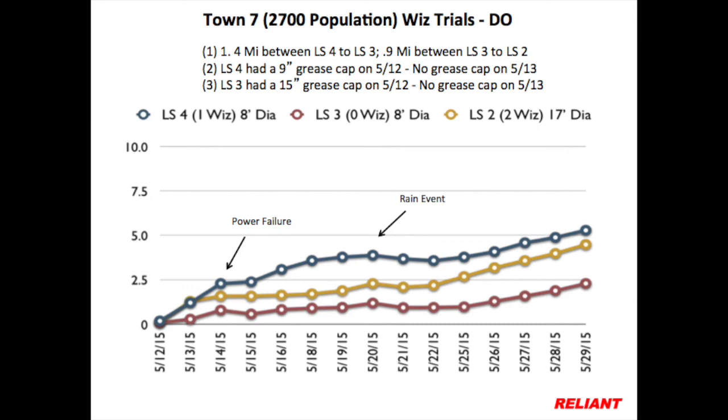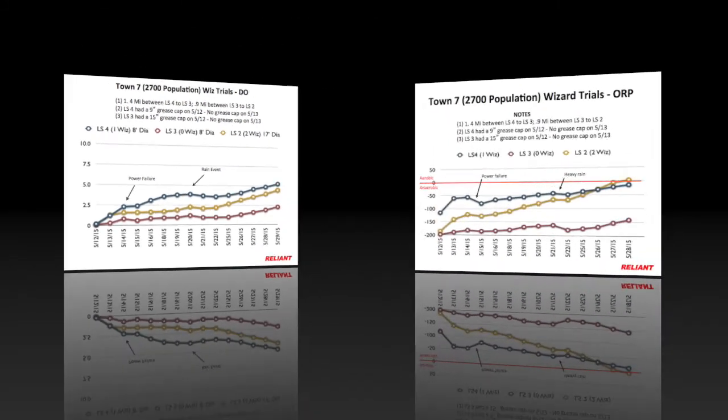Notice in this graph that the dissolved oxygen content at the beginning of a trial was always 0 or almost 0. Within just a matter of days, with the use of the Wet Well Wizard, that DO level could be raised to a level of 5 ppm dissolved oxygen even after a pump-out condition. It seems as though 5 ppm is the normal maximum in wet wells.